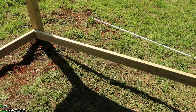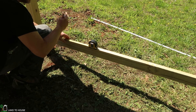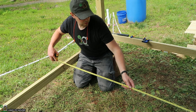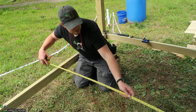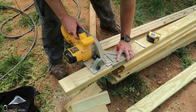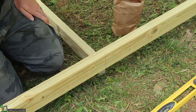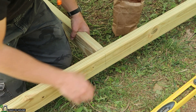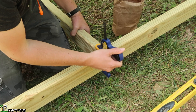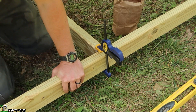It's time to get the middle pieces done. I'm just going to come in here and mark out every two feet so that I can put these middle supports in — I'm putting three of these joists in. I'm just going to measure between the two sides to get how long this needs to be. I like to use my speed square as a guide for my saw; it really makes the cut that much more squared off. Battery's dead. Some tasks can be kind of annoying when working alone — one of those is holding up a board like this and trying to nail it on both sides. So what I like to do is just put a clamp across my guideline and that holds the board in place long enough to get the other side nailed. It's just a really simple solution to holding something up.